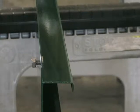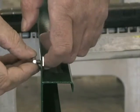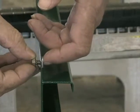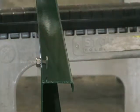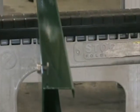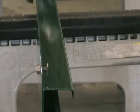The first stage of the assembly is we've gone ahead and pre-installed the bolts, the same as we did on the gutter section of the side. We put them in. Note the orientation of the bolt, its direction it comes through. This is the side that you will be mounting your glazing bars on. And if you look, we've installed them all the way along the sill section, with the exception of 2 holes. The third hole in from each end does not receive a bolt. We leave the bolt out.